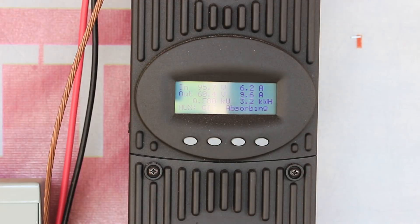Right now it's approaching the point where it's going to go into float mode. This is kind of weird because the two days after I fixed the battery problem, it did not go to float mode. It went down to about 12 amps and just sat there for hours and hours, with the batteries bubbling the whole time. I kept coming out thinking, what the hell is going on — it's not coming down to nine amps. Today it has gone down to 9.5 or 9.6 amps, so I'm not sure I still have a problem. The setting is either nine amps or five to six hours in absorption.